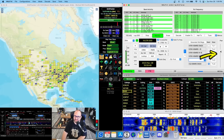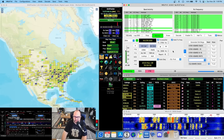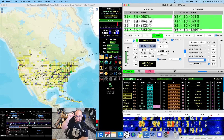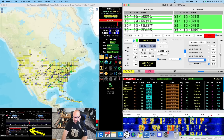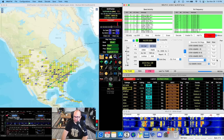This is a very common one. Nine times out of ten, it's the power slider in WSJTX. I typically run 69% power when running FT8, because it's mostly your ALC — we don't want to run any ALC, or very minimal at most. I'll hit the tune button and adjust the power slider. If I bring this up, you can see right underneath the power that blue line going up — that's my ALC. I want to bring the power slider all the way down until I don't have any ALC showing. That means I'm putting out a clean signal.